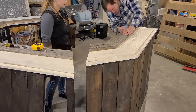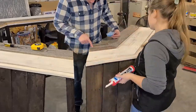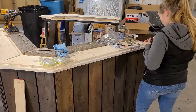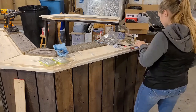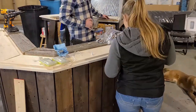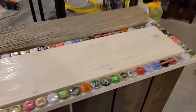We made sure to wipe up all the edges of the caulk — since it's clear, as long as the sides are wiped up it will look completely straight. Just take your time and enjoy the process. We gathered all the bottle caps we had consumed or collected from bars, organized them to look randomized, making sure duplicates weren't too close to one another. We faced them all straight forward and glued them into place using hot glue, making sure it went all the way around each bottle cap to completely seal it so no air could escape and make bubbles during the epoxy pour.